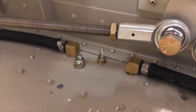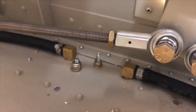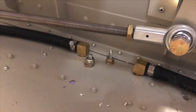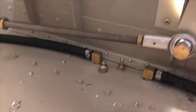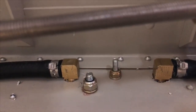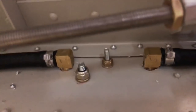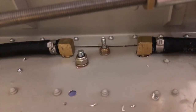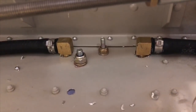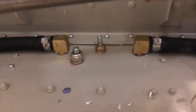You basically hang the header tank with this stud. You glue two 10-32 studs into the top of the header tank with red Loctite. Then you drill two holes — make a paper template for the studs. One is in front of the spar, and the other holds the center of the header tank, about three-quarters of an inch ahead of that flange on the front of the spar. There are two larger holes left and right of it, and 90-degree barbed elbows go in there. That's fuel from the left side and the right side of the airplane draining right into the header tank, which has all of your fuel system components right there — your fuel pumps, regulators, return system. Everything is in that tank. So it's a very clean installation.